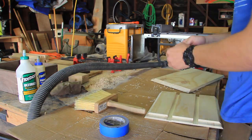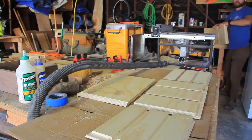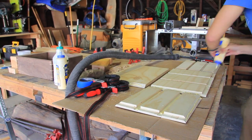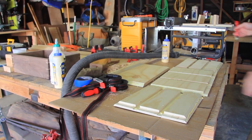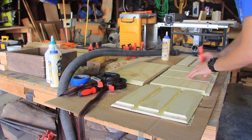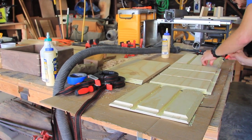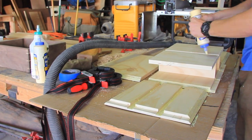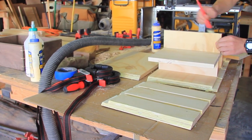At this point, it was then time to glue up the majority of the box, including the dividers in the inside of the box using some Titebond 2 and these nifty Bessey strap clamps that I picked up at Home Depot. I'll leave a link in the description below. These are really helpful for gluing up boxes like this, especially when you have 45 degree bevels.